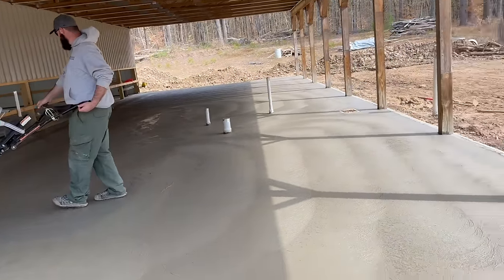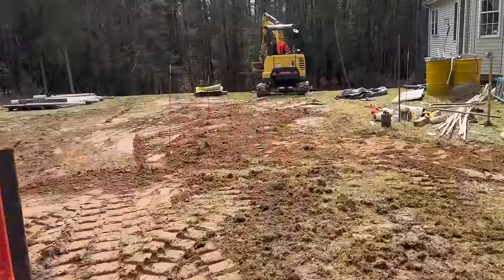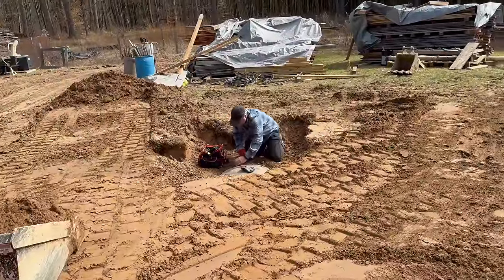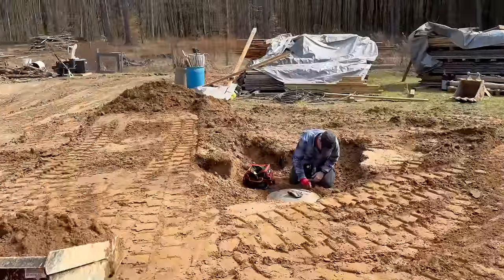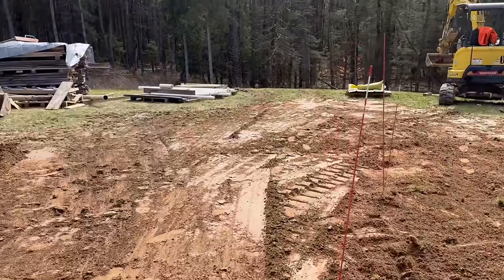And we got the septic system, the fix there, all backfilled. Just got that done. The homeowner's into the new tank, and he's gonna put a couple baffle tees in there, and then I can backfill that and then grade it all off. And things are looking really good.